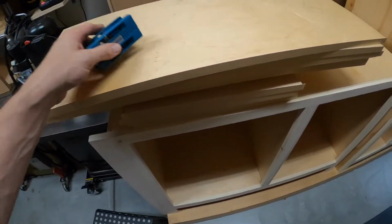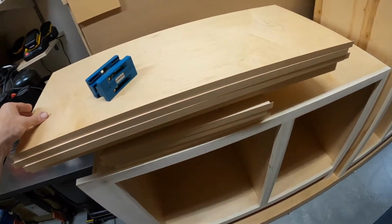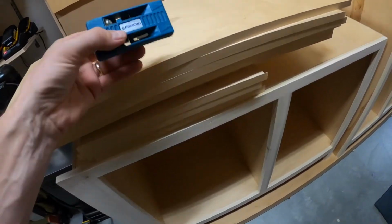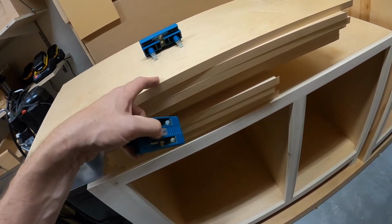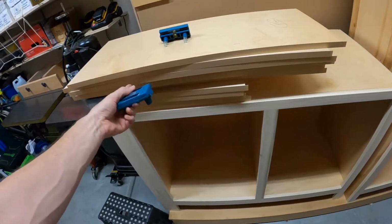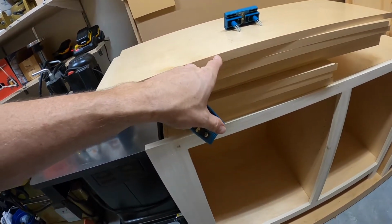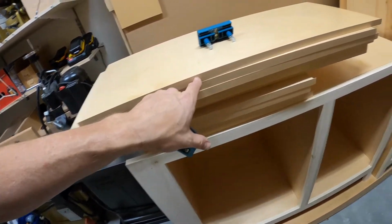So what I usually do, unless it's white melamine veneer tape, which I don't ever use, it's always wood, I take these off and separate them. That way I'm not doing both sides, because maybe I just want one side done, because the grain is going a certain direction and it's opposite down below. So let's say the grain is going, see that? It's going this way. Oops, and now it changes. So right there you'd get tear out. And it's coming up.